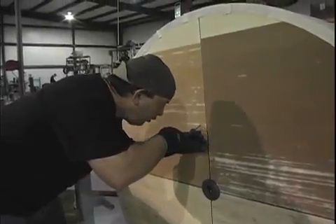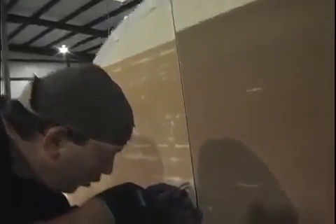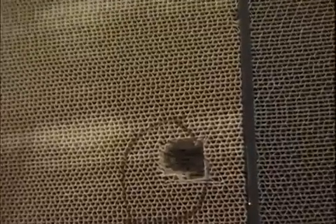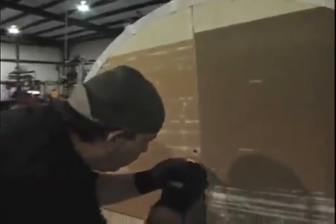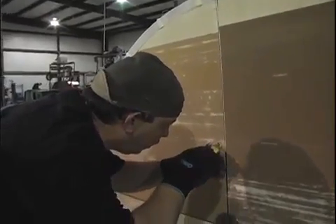Use a pair of needle nose pliers to dig out the damaged area. You can see about how deep we're going depending on the size of the patch — we'll make the depth corresponding to that. We'll want to clean the edges of the hole out and get a nice square here.